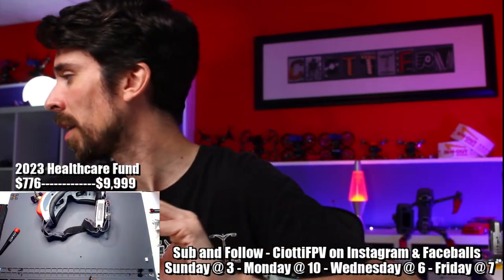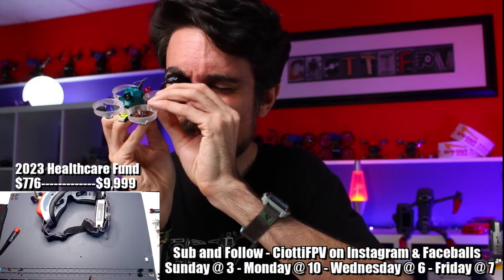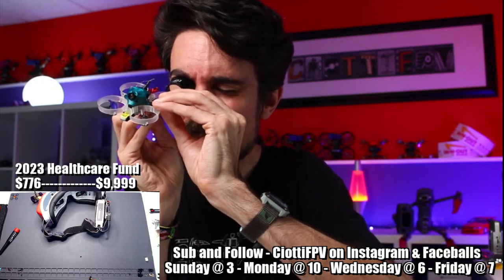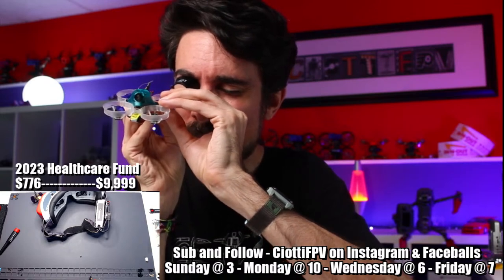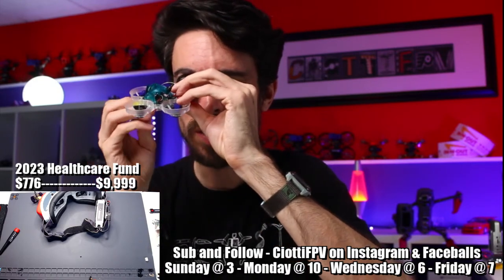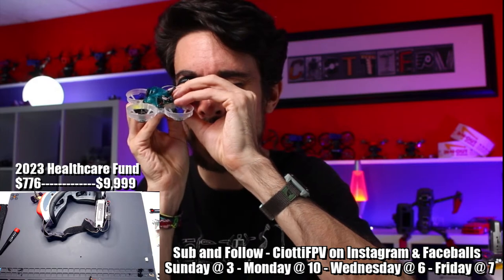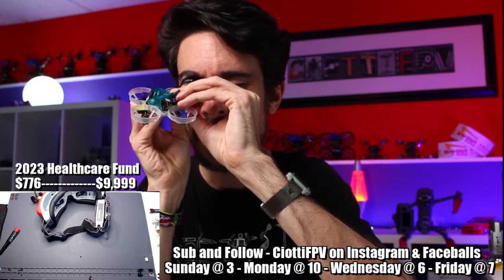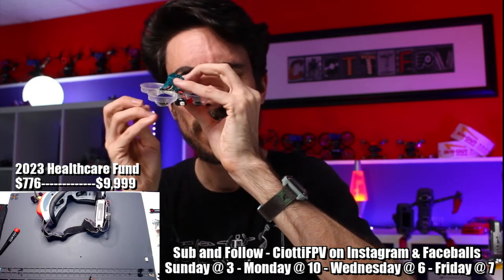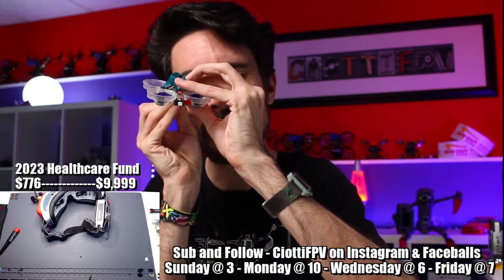source of yuck. Also, it could be that I didn't pull the windings down off the motor bells. So with me jacking up the windings and the PCBs on these motors, if there's one motor, like motor two, that's weak, the PID loop is going to pull the rest of the motors down to match it. So that very well could be what's going on here, because motor two was acting really funny. And then we saw motors three and four didn't spin up to that full 25,000, I think it was, RPM that we saw out of motor one.